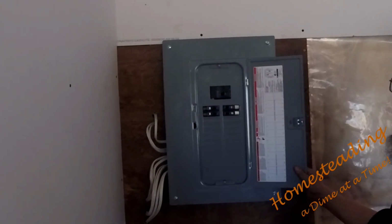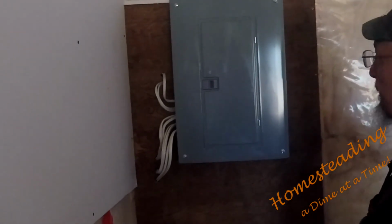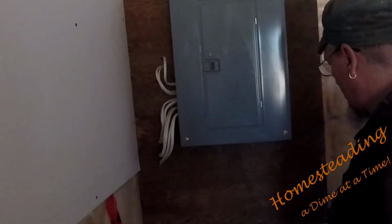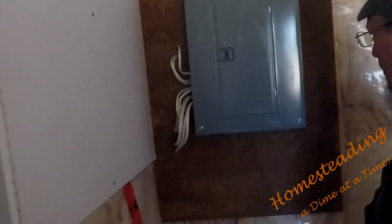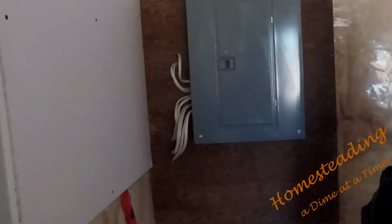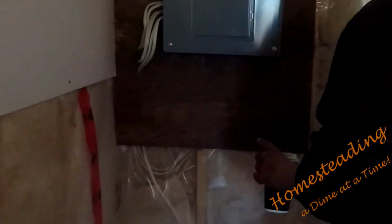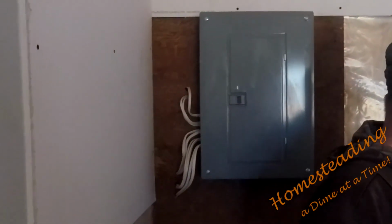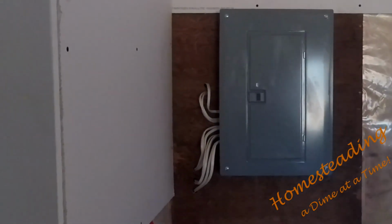The only big issue that Bernie's going to have, we're going to tape off the valve and nicely paint this. When I tape it, I'll tape the wood in, so there'll be some drywall mud on here. I'm going to tape it off so it's all sealed off nicely when I go to mud it. And I put some tape on the end of the pipe because wind was blowing in through there like crazy. Tomorrow we'll finish off hanging the drywall. With about two sheets of drywall left, this should be done. So that'll be a thing for tomorrow. And we'll see you then.